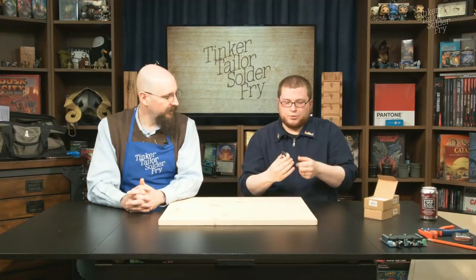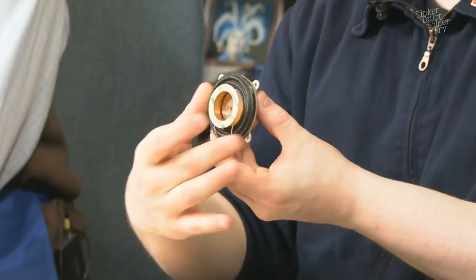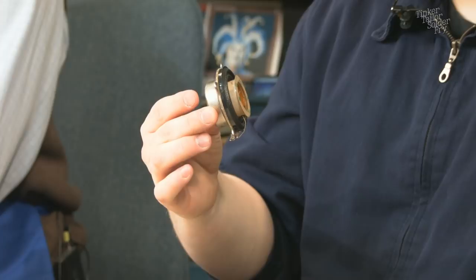This is an exciter, which has a little adhesive ring on the face. It's like what's at the base of a normal speaker cone, except designed to work on just about any surface. The surface determines quality, but it will make sound on almost anything. For something more hi-fi, we want Baltic birch plywood specifically — more plies, fewer voids, stiffer. Voids can create echoes in the panel.